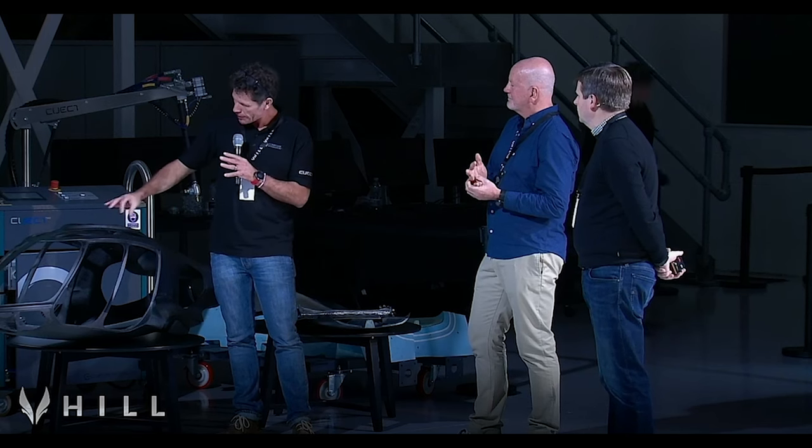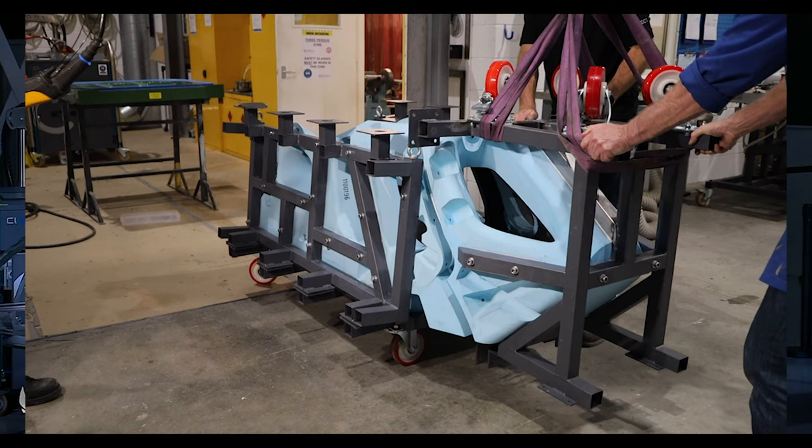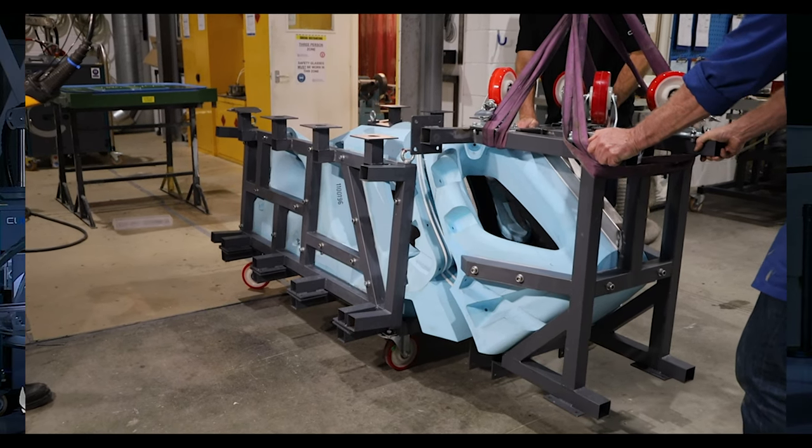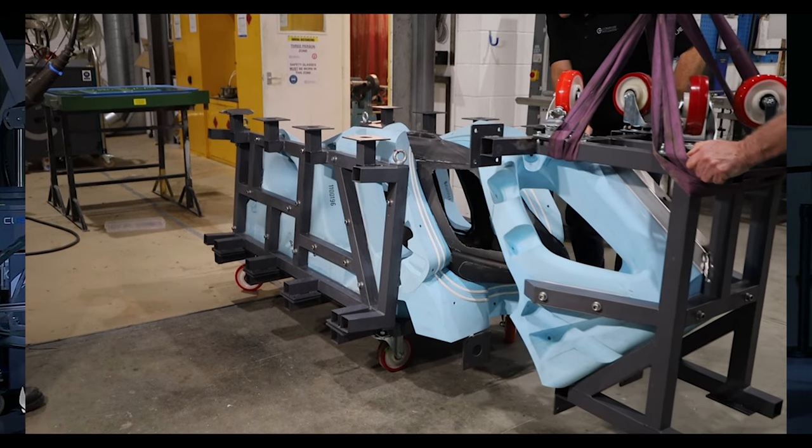Remember, that's a lot less than the kind of pre-preg temperatures that Jason has alluded to earlier. And then on Monday afternoon, the resin was introduced, you saw it in the video, and 20 minutes later, all that epoxy resin has impregnated all this dry fiber, and then the resin begins its curing process. And then shortly after that, we were able to demold. So I don't think I've answered your question, have I? Which was, how did we get all the fiber to stick in the mold?